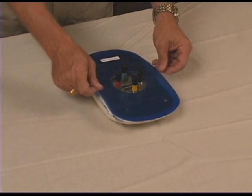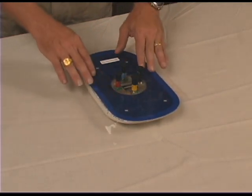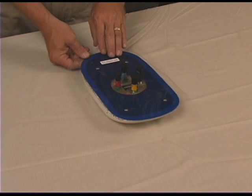Position the gasket over the antenna. Beginning at one side or corner of the antenna, place the gasket into position, carefully aligning the gasket fastener holes with the antenna fastener holes. Release film should remain on the exposed aircraft side of the gasket until immediately prior to antenna installation. At this point, the antenna may be installed on the aircraft and returned to service.